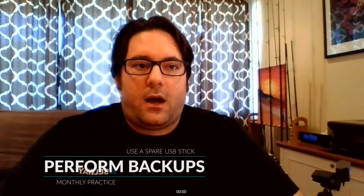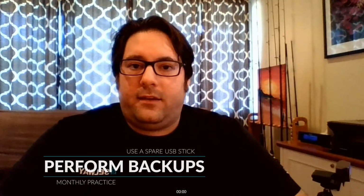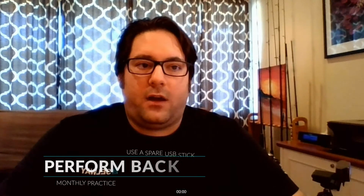Today's episode, we're going to be going over backing up and restoring your Haas control. So what I recommend doing is performing a backup. Try to do it once a month. If you can't do it once a month, then once every other month. What that does is it gives you a restore point so that if you do lose all your data, you can plug a USB stick in and get everything back in there and get back up and running successfully. So with that said, we'll go ahead and get started.